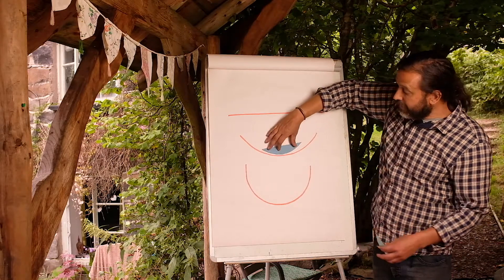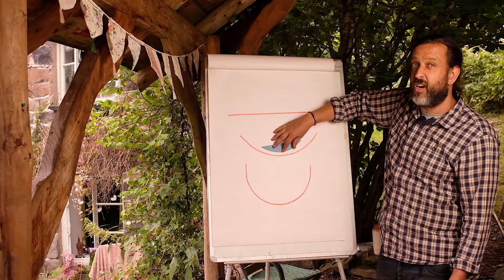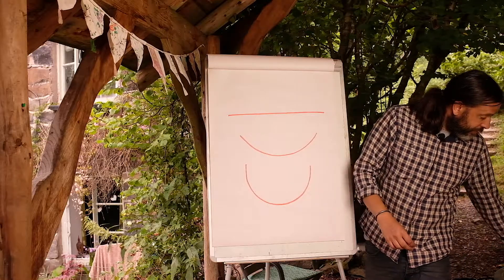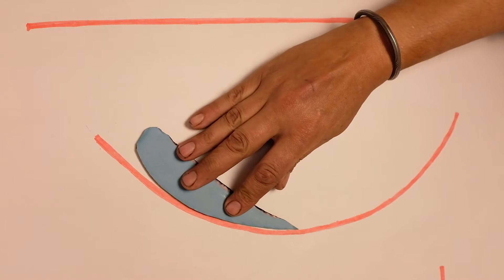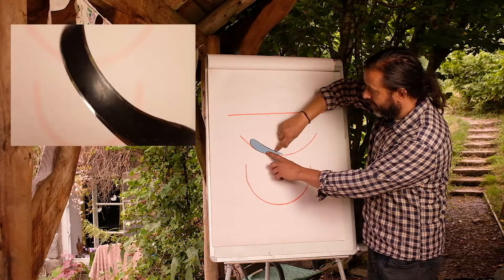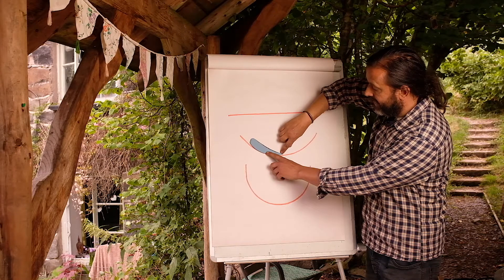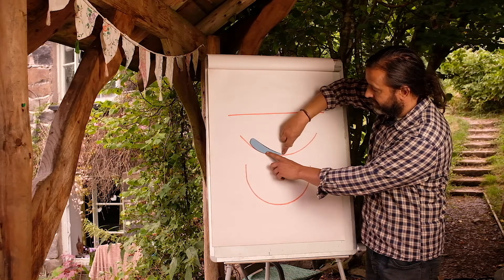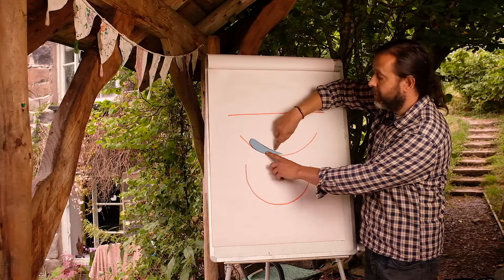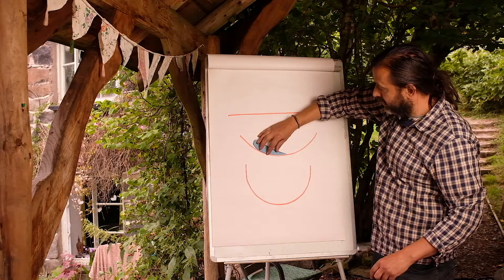However, if you were to do this it would give you the maximum strength possible because you get a good thickness and good length, but it would mean it's double-edged, which a lot of spoon carvers are not going to like because push cuts on the back of a blade are quite nice. So what I tend to do on my spoon blades is remove the back edge and round that so there's a chance to push and you've got this nice cutting action. I also put a hollow in here which acts in the same way as the hollow on a Scandi grind — it's still flat across at the edge, but I've removed the center which just makes it easier to sharpen. The wood does not know about this hollow — it makes no difference to the actual quality of cut, but it makes the sharpening experience much easier.